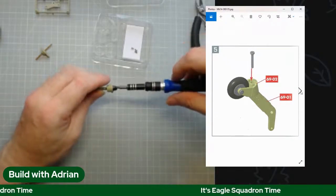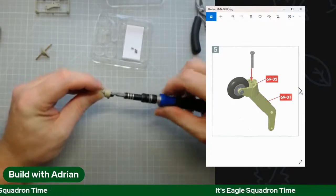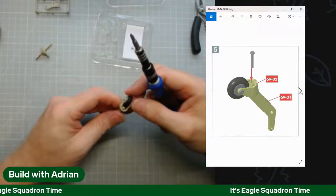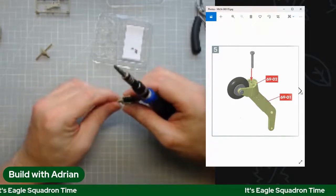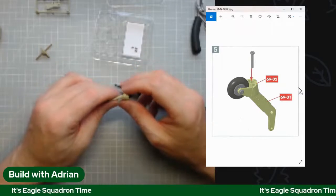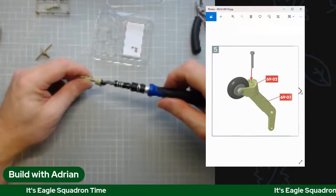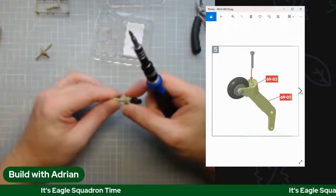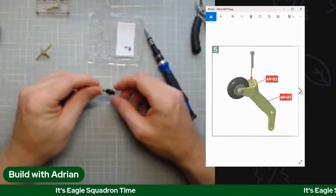That's a rather odd statement. Well, how can it pivot when you've got a peg? Yeah, there's a locating peg which prevents it from moving. Unless it's actually designed for slight movement. Probably the peg is slightly smaller than that hole, and basically there is slight movement in that hole. Well, it couldn't be very much. It depends how much tightness you put on that screw, basically. Yeah, okay, I'm going to have that slightly loose then. There's a slight play on it.